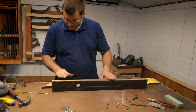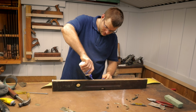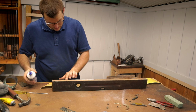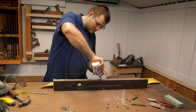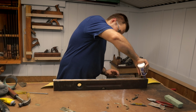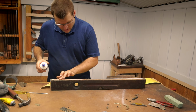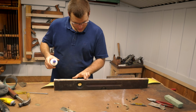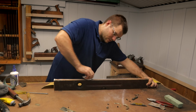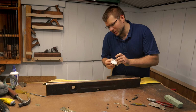So we've got these little lines here, so as I'm sanding this, what I'm considering doing now is running some glue along in these areas, so as I sand it, it sort of fills all the gaps in. This will actually act as its own sort of putty. Most people will have seen this trick before. And it's quite effective, especially in restoring old pieces. So just wipe the excess glue off the surface. We don't want to gum the whole thing up.